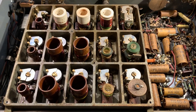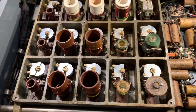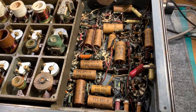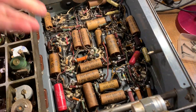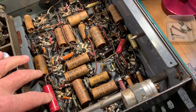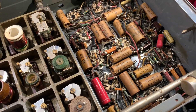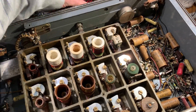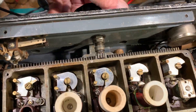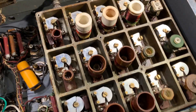Hopefully there's not much to do in the coil box — I opened it up just for a quick demo, take a few photographs. Spiders have been in here, but otherwise it looks in pretty good shape. Most of the capacitors in this radio are the original waxed paper type, there's one or two replacements. I think I saw some on the power supply section on the other side of the chassis as well. Let's put the coil box over — this big rack and pinion system there, it's quite remarkable, who ever thought of that?